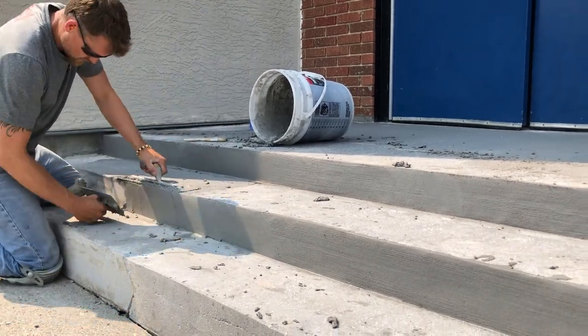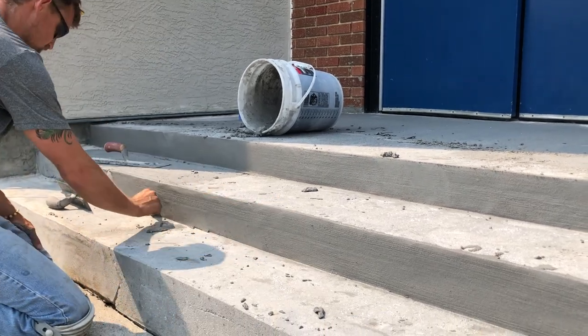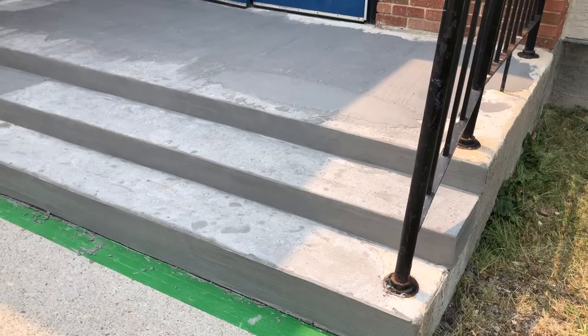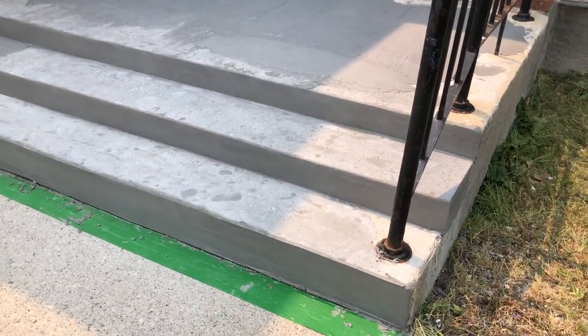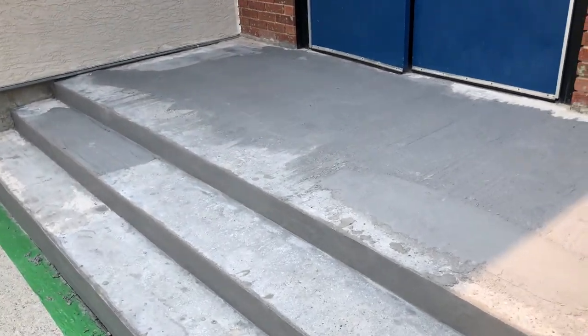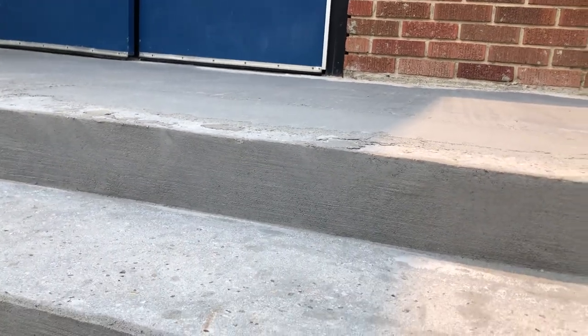Here's a technique where you can take a little bit on your trowel and use a top trowel to spread the mix right up into the riser — that will really help keep it on. You can make the mix a little wetter or a little drier depending on your preference. If you go drier you can get it a lot flatter; if you go a little wetter you can use a paintbrush or small broom to smooth it out, which will leave some light broom marks in the riser.